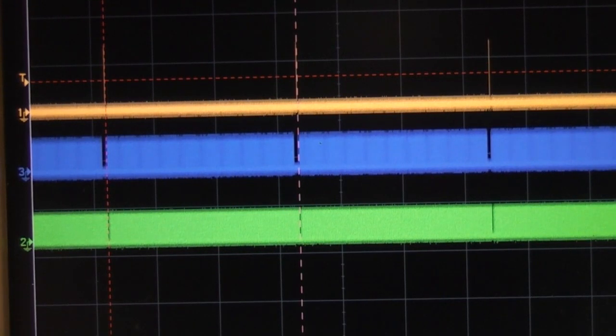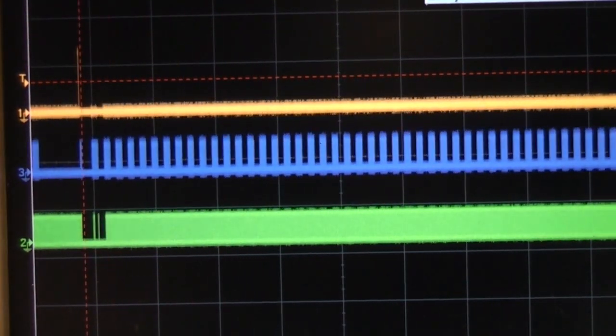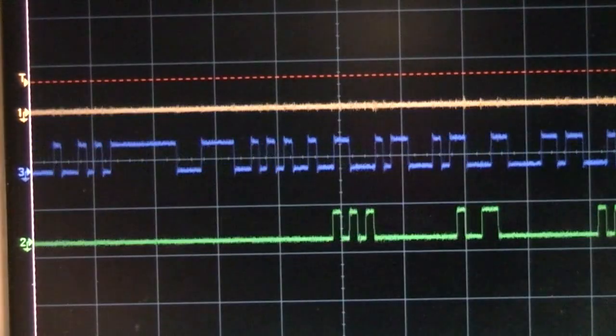I've got another couple of these on order, so as and when they arrive I think I might sacrifice one and do a full strip down, take the chip off and trace all the connections out, because it probably wouldn't be that difficult to run some code. Also, because the code's held in that external chip, and I believe there's a firmware file as part of the install package, you could probably get some useful information by disassembling that, which might at least give you some clue as to which data is coming in and out, and some idea as to the meaning of this stuff here.